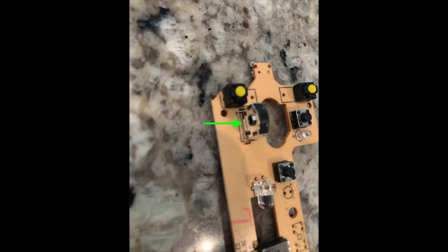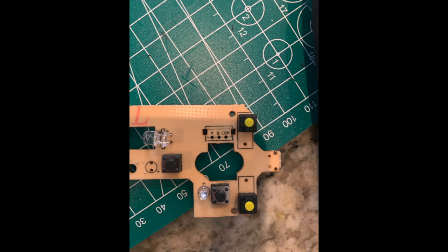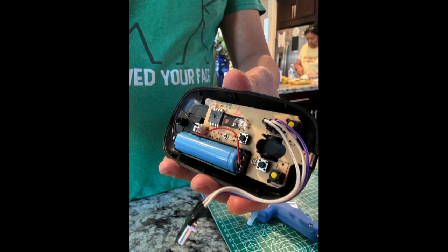After buying the parts, I had to disassemble the mouse and desolder the rotary encoder, then attach some cables to it so I could reposition it from a vertical position to a horizontal position. This is what controls the volume, and then there's the left mouse button and the right mouse button. These little buttons are actually just glue sticks that I cut and use as triggers for the left and right mouse buttons.